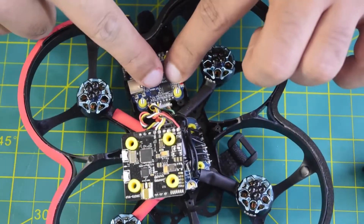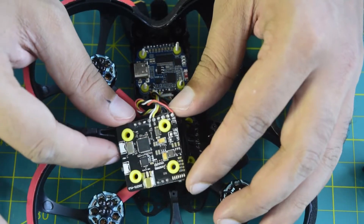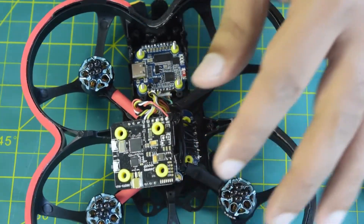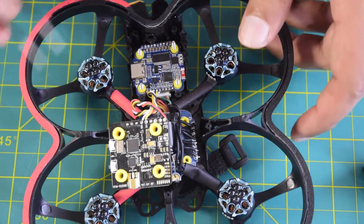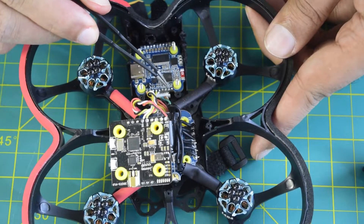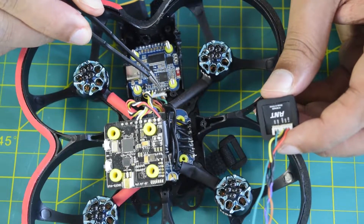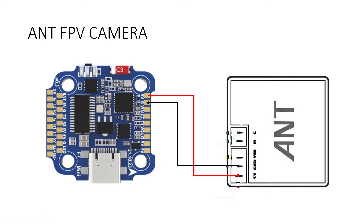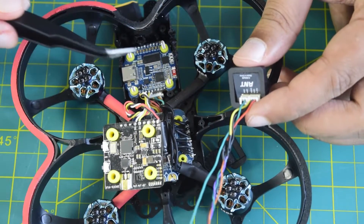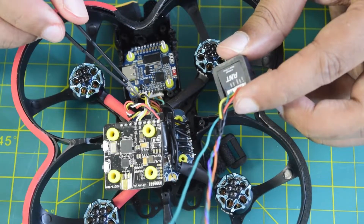On the back side of the drone frame, I have already installed the flight controller and connected the VTX in my previous videos — links are in the description. On the flight controller I have 5V and ground to power the camera, a camera input or video signal input where the video output of the camera connects, and a CC or camera control pin where the OSD menu control connects. This allows you to control the camera menu options directly from the flight controller using the remote control.